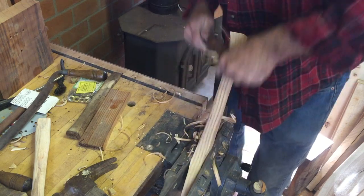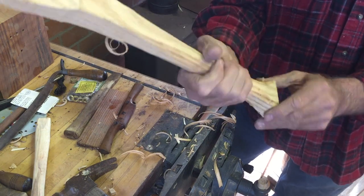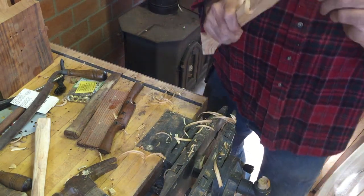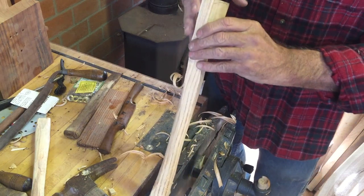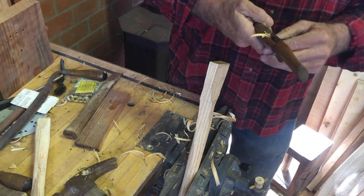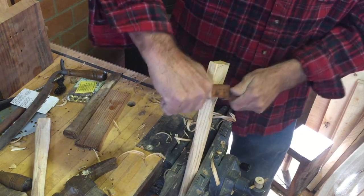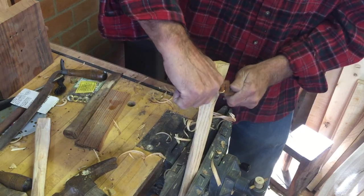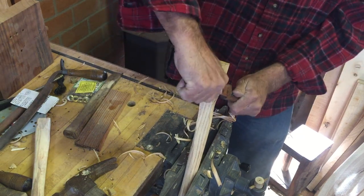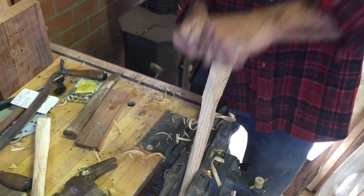In just a couple minutes I've got the comfort of the handle made — that part is pretty much done. I'm going to do a little flare on the end, but I'll wait till the end. Now I drew out the shape of that pick head on the top right here. I can put the handle in and go very, very carefully with the spokeshave and shave down to that point. I'm looking at the drawing on the edge and trying to leave a little bit of the pencil mark, because I don't want it to be loose — I want a nice tight fit.